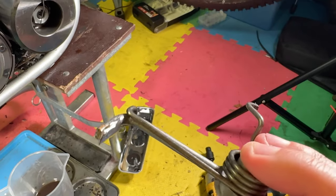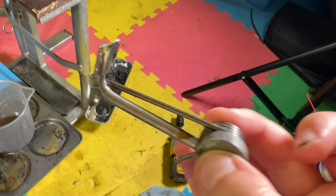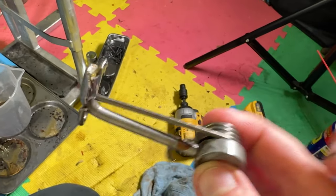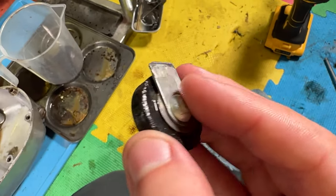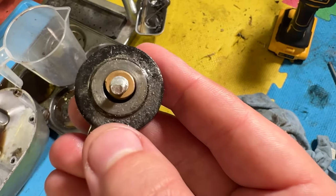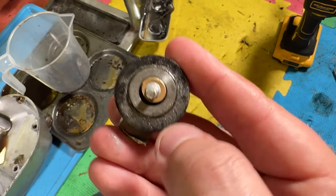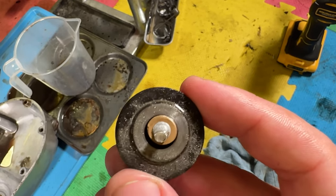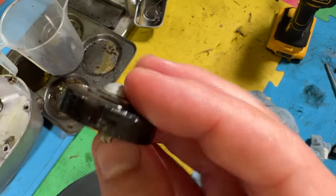Without the tensioner it turns beautifully, so this has got to be the issue. I'm going to replace it with whatever the appropriate design is — I don't know what should have been on this, but it looks horrendous. The rest must have broken off somewhere. I've also found the little wheel that should go on the tensioner — look at the state of that. The aluminium bit in the middle should spin on the brass bush, but the brass isn't even round. All of this has pretty catastrophically failed.